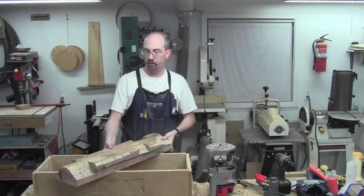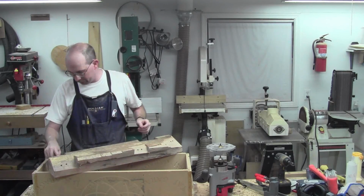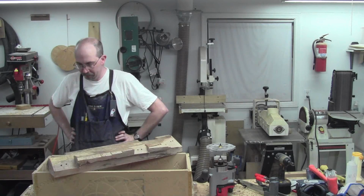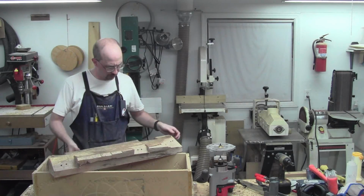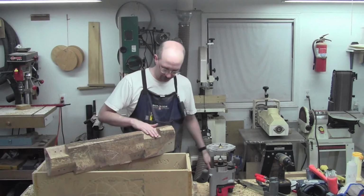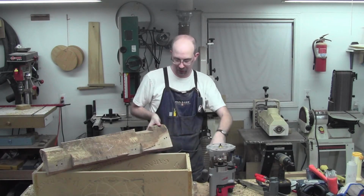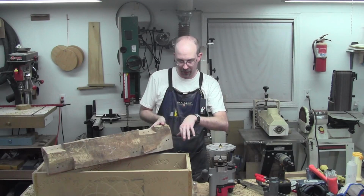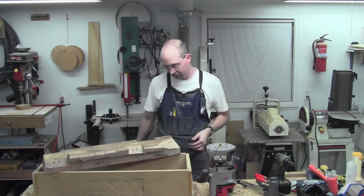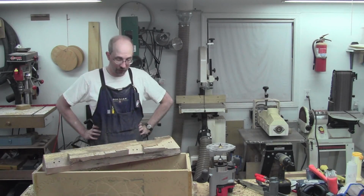Okay, well, looks like a tree trunk to me, yeah? It's a good day. I can see here now where the rot is. The rot is only going in about a quarter, maybe a quarter inch. And we're not going to bother with messing with that too badly, I don't think. Yeah, so we've got all our facets made. There's 2 for a feet, and I'm going to put a foot straight out to the bottom of the center. There's a facet here for a branch to come out this way, and this facet will do the same. It'll come out this way and support the tabletop. There'll be a little tiny one that just comes out of here. It's not going to come out far, just a little bit, at an angle, and it'll support the center spot so that it can be supported in the middle. That's all of the joinery facets that I need.